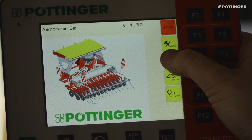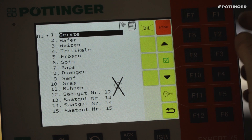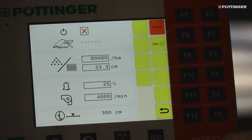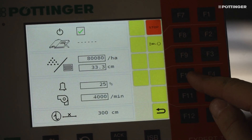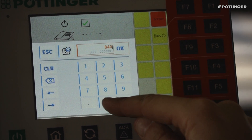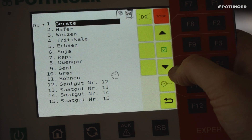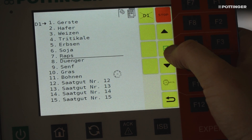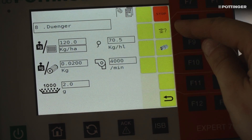For successful precision seeding, the PCS elements must be activated at the control terminal. To do this, go to the set menu, then to the seed library, and activate PCS separation. The application rate is entered by specifying the number of seeds per hectare or the seed spacing in the seed slot. There is no need for an additional calibration test. In the seed library, you can also activate D1 metering for adding fertilizer or a companion crop, and a calibration test of those additional components must be carried out in the same way as for drilling seed.